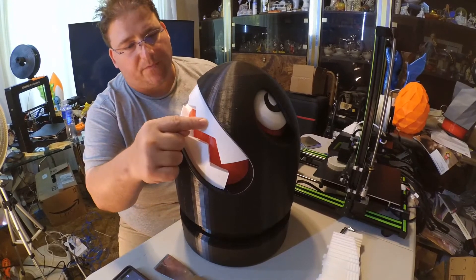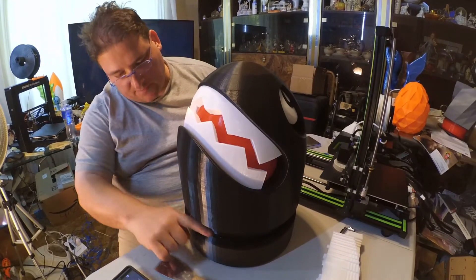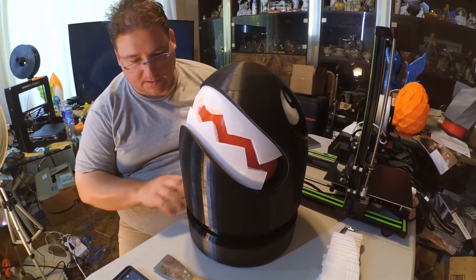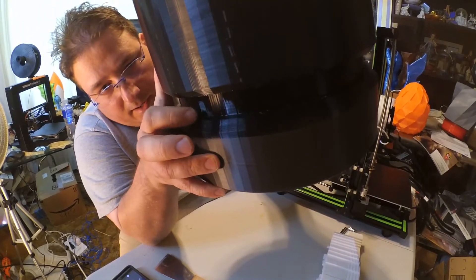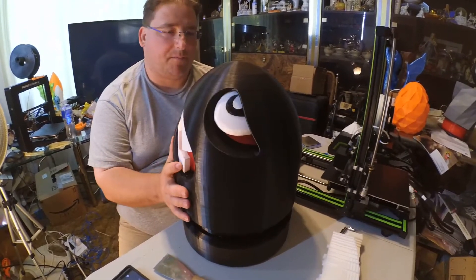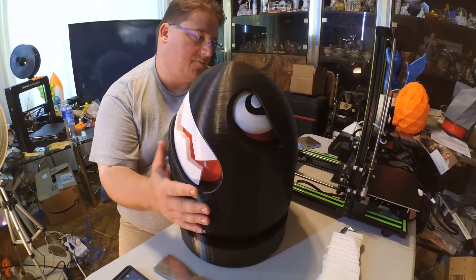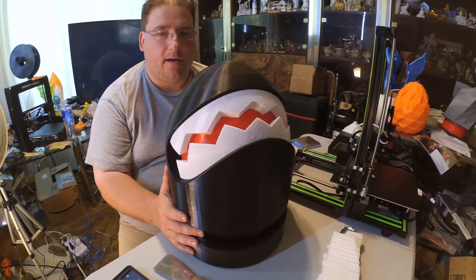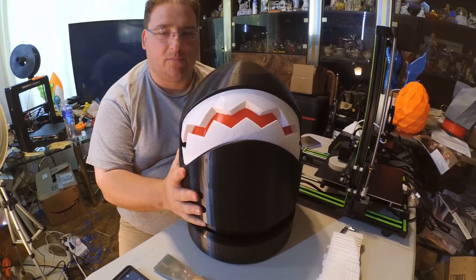I really should have gone to about 1.8 kilograms — increasing the infill in these teeth. The bottom teeth needed more infill, and I needed to increase the infill where the bullet flattens out and plateaus when it joins together. That needed a little more infill. An optimal mass ratio would have been about 1.8 kilograms, but I actually could have lightened the main body infill too. Very cool model — now I want to try to print a tiny one just to have a little Bullet Bill next to the big one.